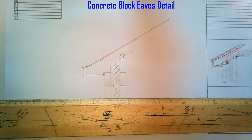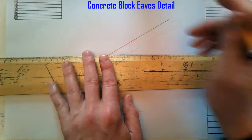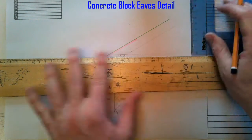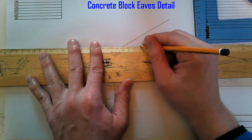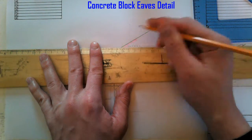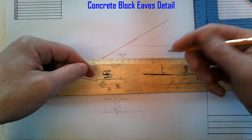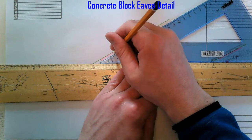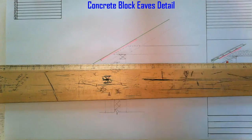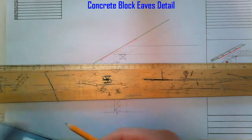I'll put in my joists next — my joists also sit on top of the wall plate and they're 150mm. When I get to the rafter I'll use a dotted line because it's hidden detail, which means they're fixed on the back of the rafter. Also, you don't want it to run on and hit your vent, so we're stopping it short — just to show you your vent. That is our joists in place.